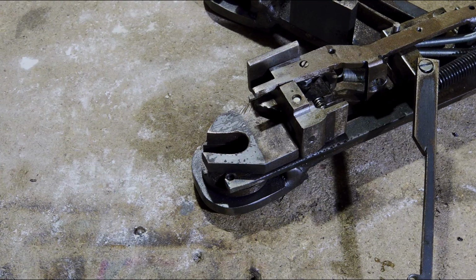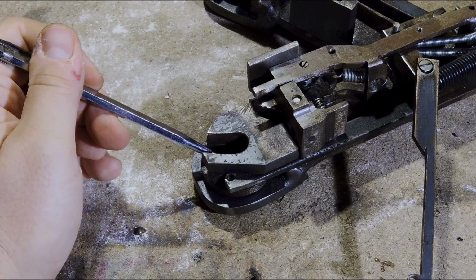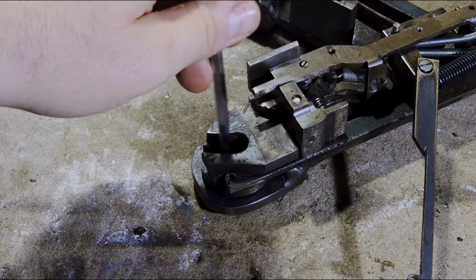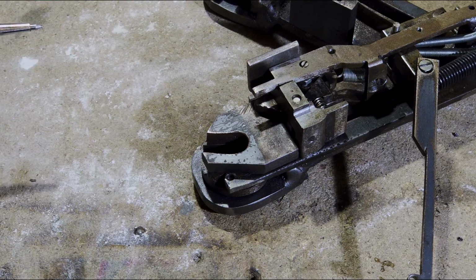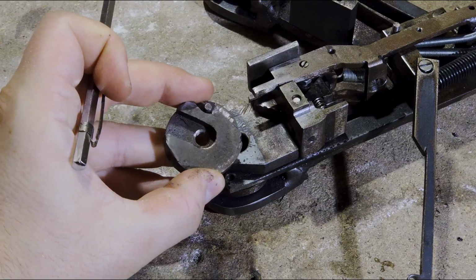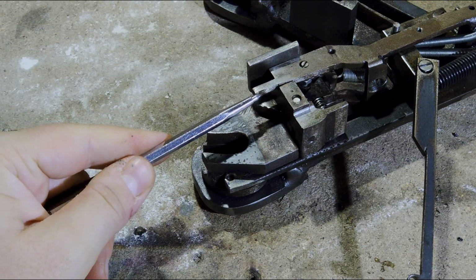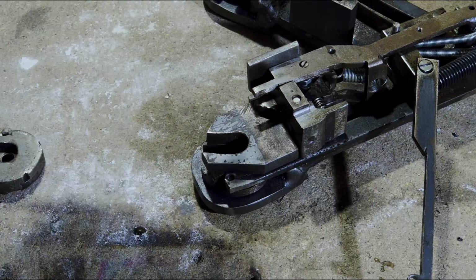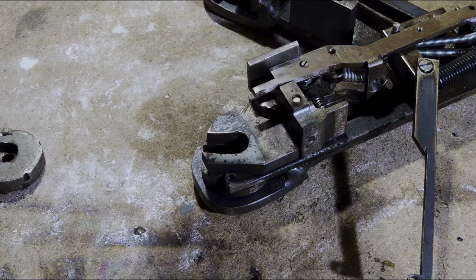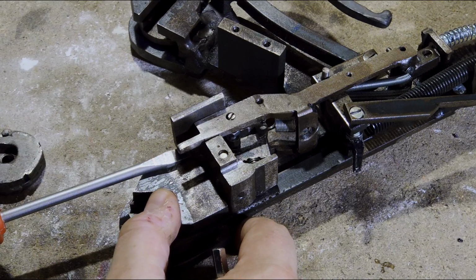Now the other thing that happens, the discs rotate back into alignment with the handle. This first off means that you can now remove the blade. Secondly, it means that this little notch I keep mentioning is now aligned with this catch again. So this entire thing is now locked in the open position and cannot just simply close again. This would be the situation you had on your hands after you folded the handle again. The blade would still be in here.